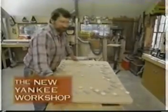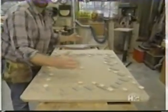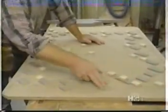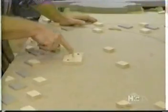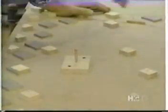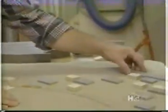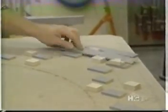To make the decorative arches, I returned to the jig that I used to make the railings. The arches are a little bit wider and shorter than the railings, so I had to establish new lines for the sides and a new line for the bottom. I also installed this plywood block with a dowel pin in it so that I can use my router to actually trim out the arch. I've pre-cut the pieces of lattice a little bit longer than what I need, and we'll just set those in place.